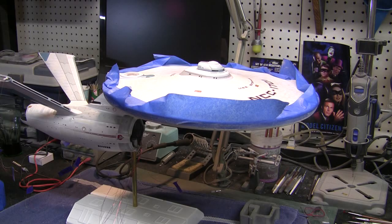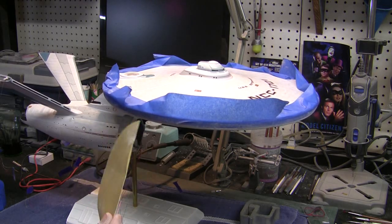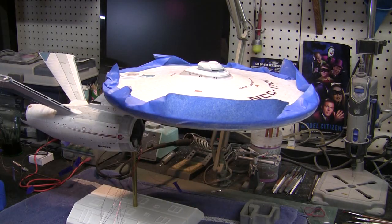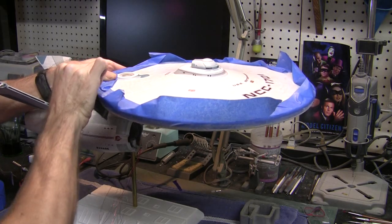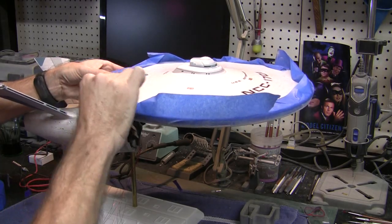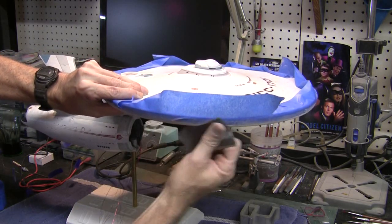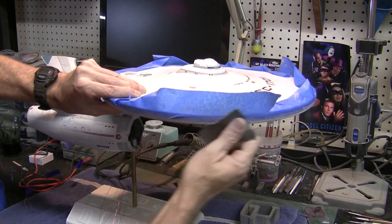We're working on the saucer and I've got her all masked up. I've already worked my way around the edge with some 180-grit sandpaper — sticky-back DA-type paper, folded over for a nice smooth edge. Now I'm switching to 320, which is a finer grit, and just scuffing this down. I've already got it worked down pretty smooth, so now I'm going over it to remove the deep scratches from the 180. The fine scratches from the 320 will be easily covered with putty. You also want a little bit of scuff surface on there so the putty will stick really well.